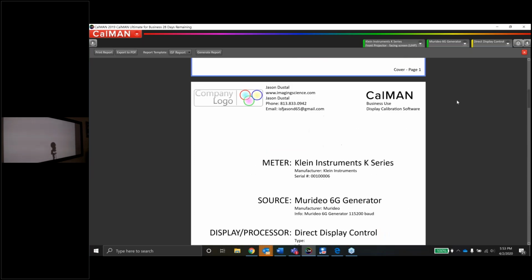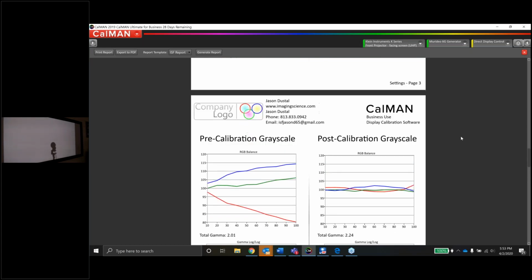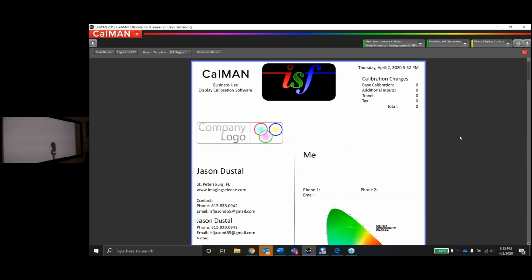This is a good SDR calibration. If this was a real world environment, I might sit here and work on it some more. Maybe do a specific dedicated dark mode. I kind of did more of a bright mode for this session because, again, it's daytime out. I've got some ambient light in the room. I do have blackout curtains, but they're not perfect. The walls are white, so I went with a 2.2. If this was the real world, I'd probably spend a little more time and do a night mode as well.